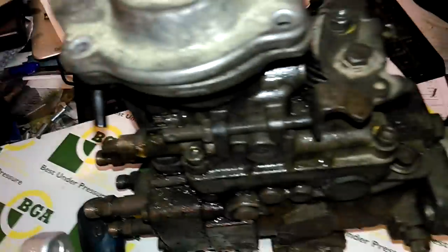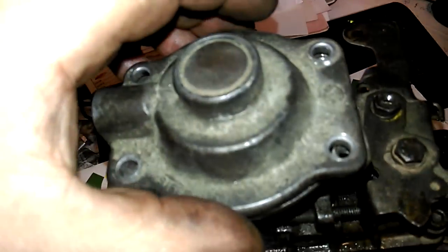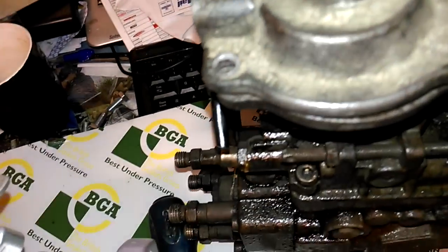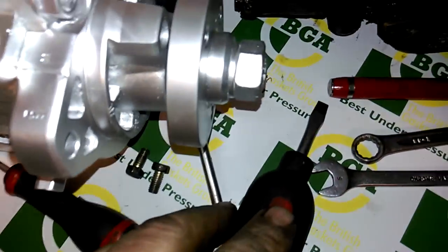What you have to do is go back over to this pump. Take your four screws at the top - you can use a 9mm spanner, which you can basically bump over the top of the screws with a hammer just to take the pressure off them, and then use a straight screwdriver to undo the screws.